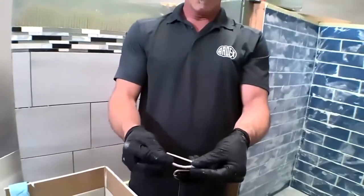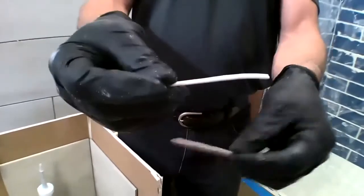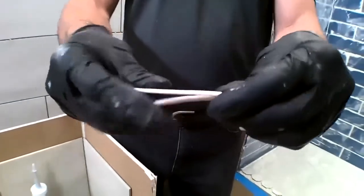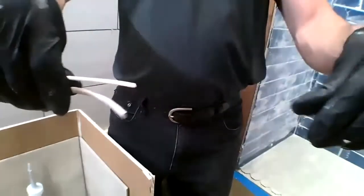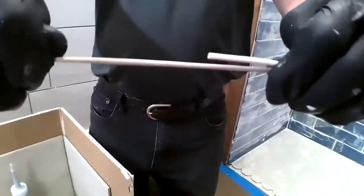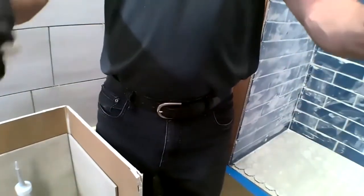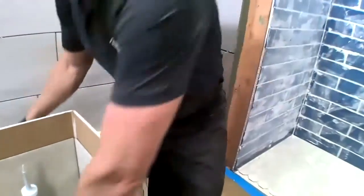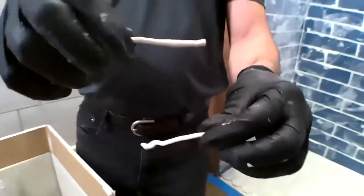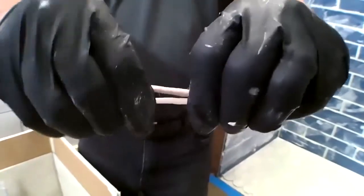of silicone versus acrylic. So this is a piece of dried silicone, and this is a piece of acrylic, like sanded caulk. I'm simply going to pull on these two pieces and watch what happens. So the acrylic broke and the silicone goes that much farther. Here, I'll do that again for you. Again, silicone on the top, acrylic on the bottom, and we're simply going to pull on them.